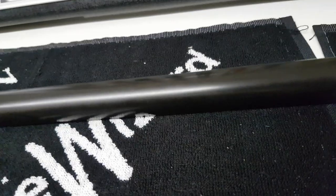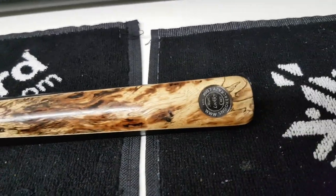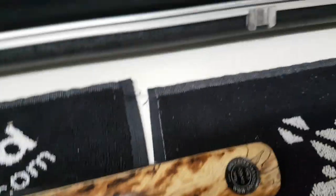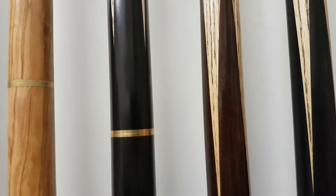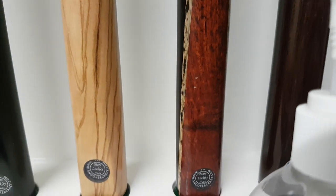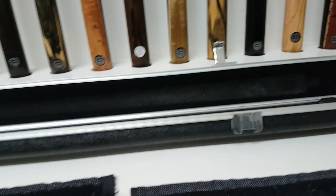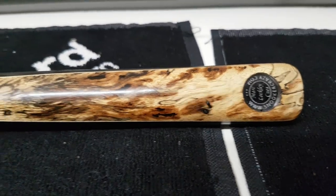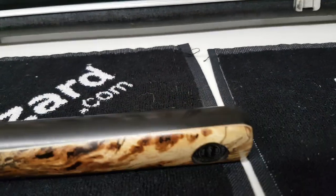Sometimes, although I give it a finish above the sand and sealers, I like a wax oil on there as well. It really depends what the wood is. If it's something like a Makassar or something like that, I would probably just use the oils in the wood — some woods have natural oils. So I'm just going to move the camera, I'm doing this on my phone, sorry about the pictures. Something like the middle one there — I would probably use its own oils. This one has a lot of oil actually in the butt itself, so probably use that. But you can tell it's a lovely bit of wood, and it just looks a little bit better with an oil wax mixture.